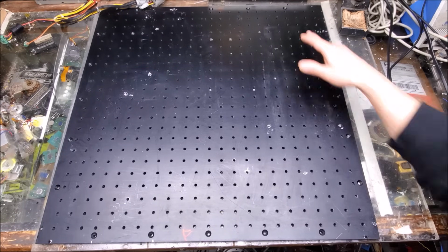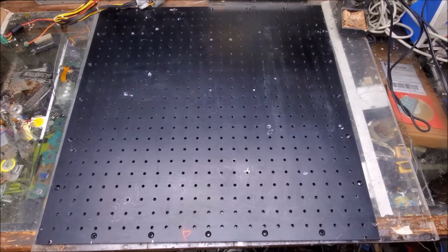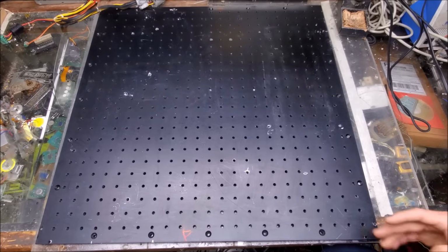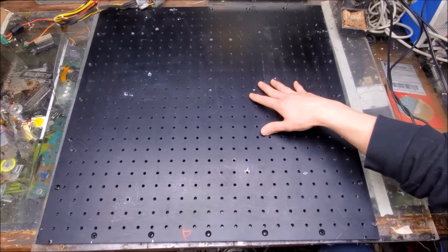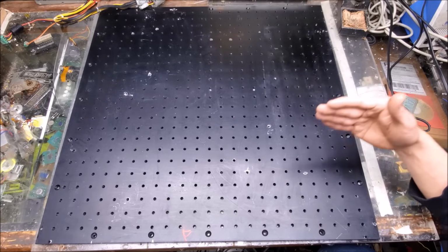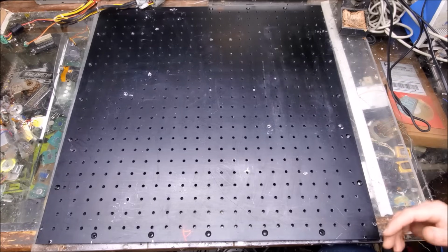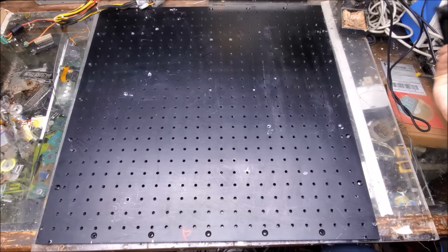So I'm going to work mostly from the back and this way with my part selection, and I'm going to start with the fans. So even though it's about 65 watts of optical output, because of the efficiency of the lasers and other components like the TECs and so on running inside of the laser, it's going to be a couple hundred watts of thermal energy that we need to get out of the laser. So that's going to require a pretty hefty cooling solution.